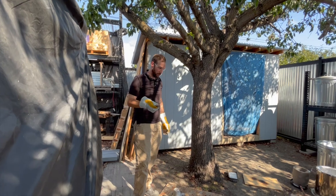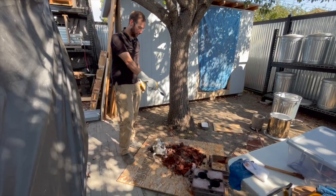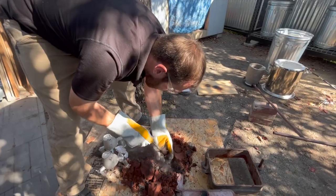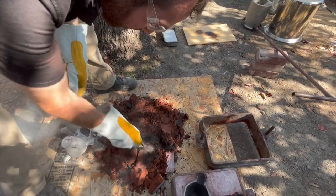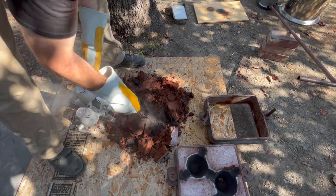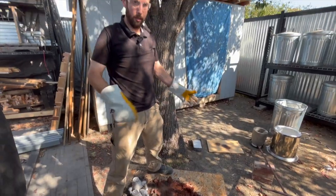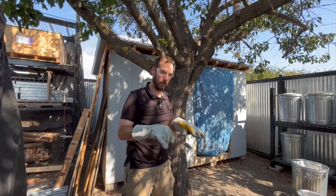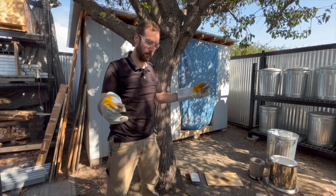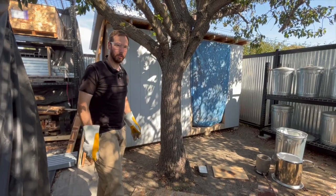The next project, we're going to build a small sand mulling machine. You can see a lot of the black burned sand in here - this stuff is completely useless. You can break it up but if you try to mold with it you won't stay in place and you'll get all kinds of mold defects. But with a mulling machine you can just throw it all in and it'll recondition it - maybe add a little bit of additives, oil or water, whatever you're working with - and then you take it out and put it right in your mold and keep going.